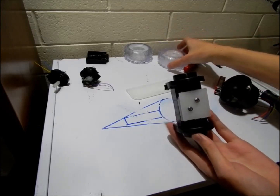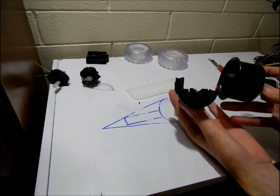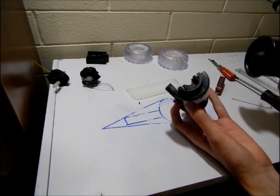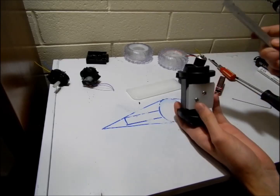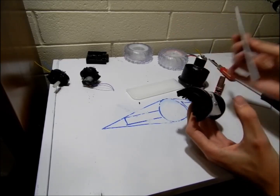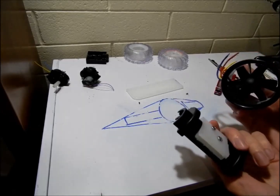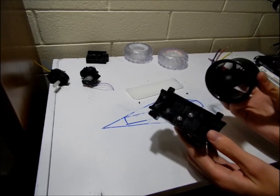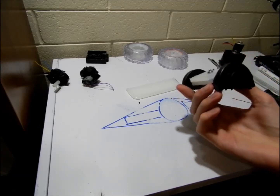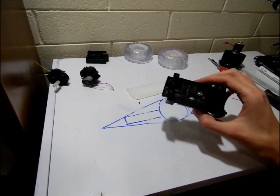The current plan is to build the frame from more cutting boards. There will be a piece of cutting board cut to expand out to the width where the wheels sit, with holes cut at the back to hold the EDF. There's going to be a little hole so the EDF's brim sits in underneath the base plate. If I get the metal piece cut nicely, it will drop the base of the cutting board down by an extra 3mm, which will bring this guy closer to the center point of the wheels. I think I'm a little behind and may not finish in nine hours, but let's keep going.